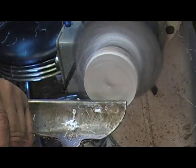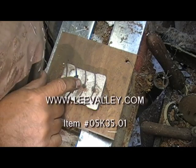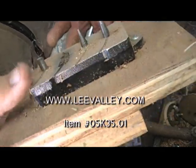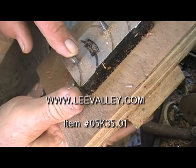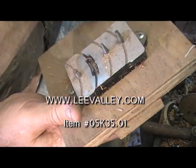Now, I talk about something you might not be familiar with. This is a burnisher. This one comes from Lee Valley Veritas, and these are really nice. These are hardened pins up here, and they're slightly tapered, you see? The push-off pin is this one right here. What I'm going to do is roll off this pin and curl against this one or this one.